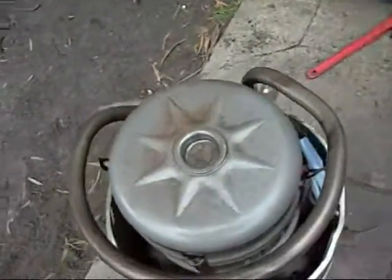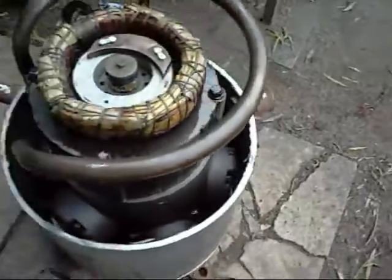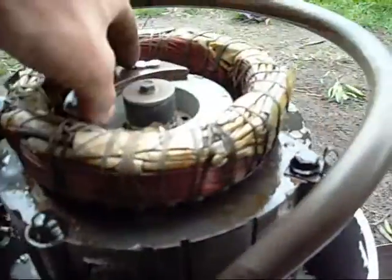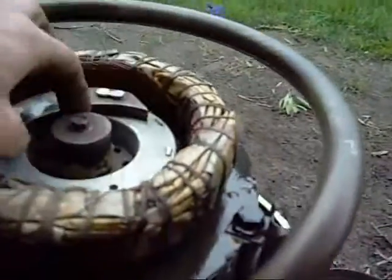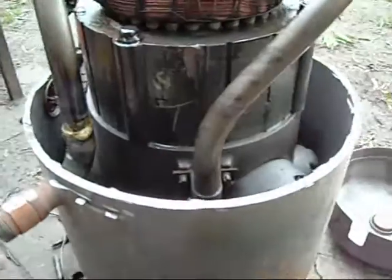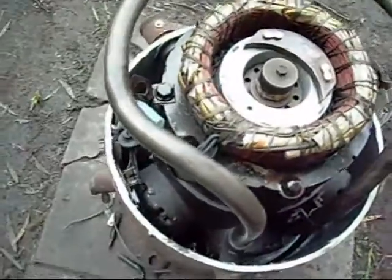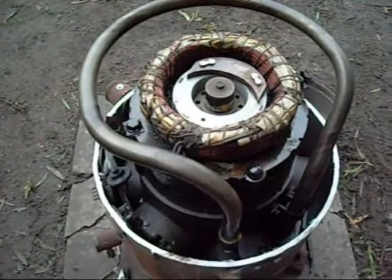Under this shield I'm trying to find something to pop it off — now it's stuck. That's the motor stator underneath. There we go — and that's the motor right there. It's sticky. Don't know whether this is the bad one or not. Oh, it's been rewound. Apparently one of these compressors is bad — I'm sure that's why they scrapped this package unit. It's the same package unit that the cycle reversing valve I showed came from.